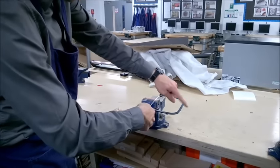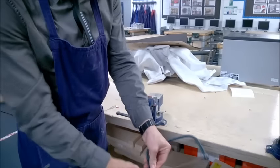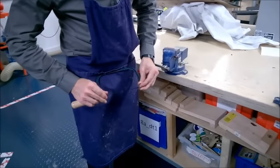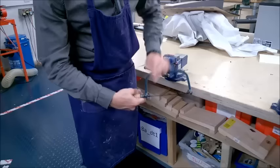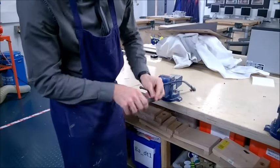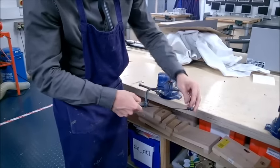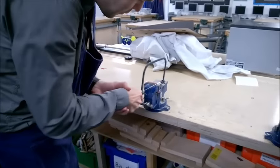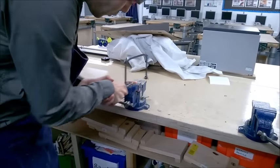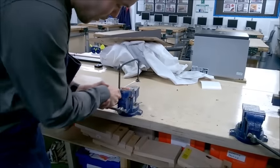If I start cutting, the frame will get in the way of the vice. So I hold the pin, loosen the frame off, and pivot both handles around their pins so they are in the same line but the frame is well out of the way of the vice. I tighten the pin by holding it and turning to the right — righty tighty, lefty loosey. Now using the edge of the vice I cut with long strokes towards me, and even if I don't go perfectly straight I won't go over my line.